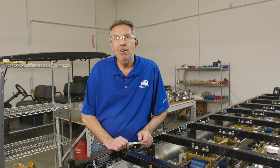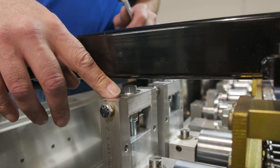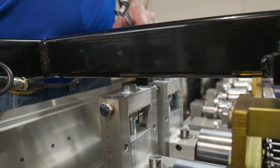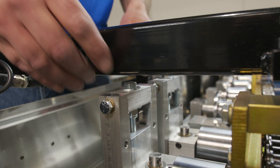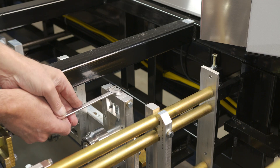After this adjustment, now let's fix our downhill on our outside leg. Since we saw downhill on the female side of the board and batten, we've got to make a slight adjustment to the camber station. You'll need a 9-16th wrench. On your last station, since we're going downhill, take this last station and bring it up — do the opposite of what the panel's doing. If it's going downhill, turn the bolt clockwise a quarter turn; that will raise the station up and stretch that material to run straight. On the male side, even if we ran straight — for example, if we were running downhill — take your 9-16th wrench on the last camber station and turn it a quarter turn up to make it run slightly uphill so it runs straight. If you're running uphill, turn a quarter turn down to make it run slightly downhill so it straightens out and runs straight.